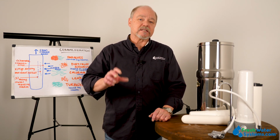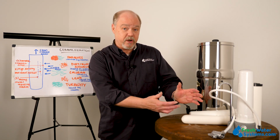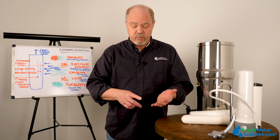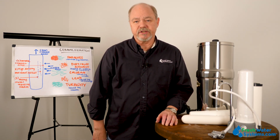It really depends on your application. And depending upon what kind of water you want to come out the other end, ceramic might very well be the best choice for you. In other situations, if you want to reduce inorganic dissolved solids, then ceramic's not going to touch those.